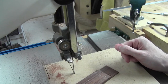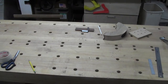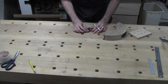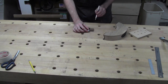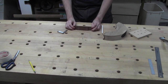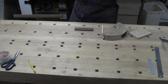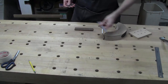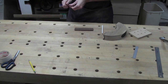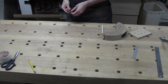I'm going to lay out for this curve — that's the next bit. All right, so I'm going to lay out the heel shape. I'll cut it on the rear end. What I'm doing is transferring the vital lines: the center line and the line where I wanted the main curve to stop. I said about an inch and an eighth for the final width at that point, so I'm going to go with that. Just set my square here and double-check that it's where I think it should land.